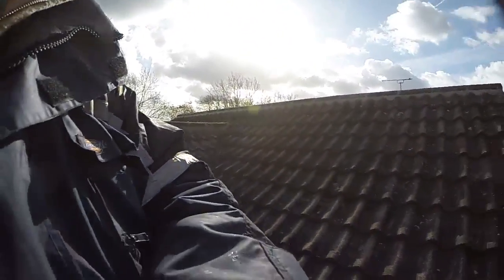So we just really wanted to show this one and just say that we do flat roofing as well. So you know, there's two types we can use: the torch on felt, which you can get in the brown as well as the green, or you can actually do the fiberglass roofing, which is a little bit more expensive but lasts a little bit longer.